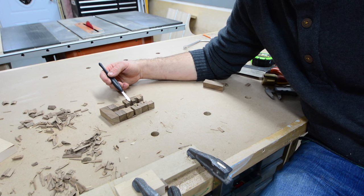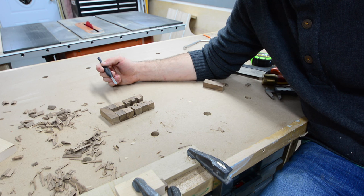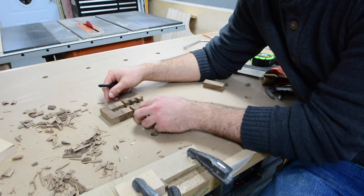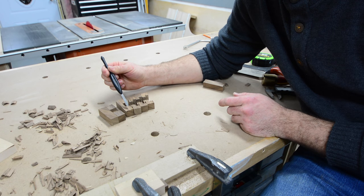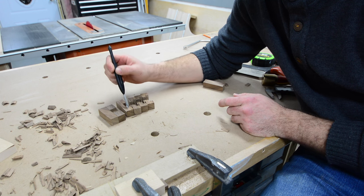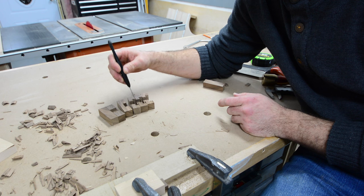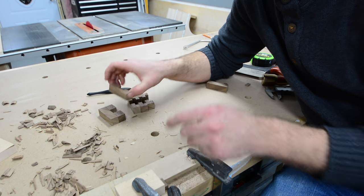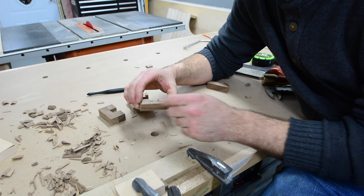I did my three inch and a half by three eighths inch dados, and I'm almost done. I got one more to do. This one again is flipped 90 degrees, and again a half an inch from the edge will be another three quarter by three eighths dado — instead of the inch and a half, it will be three quarter. So I can use my same jig again for the first saw cut, but then I'll have to move it to do the second one to get the three quarter.